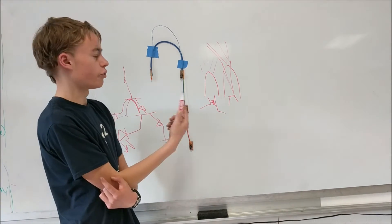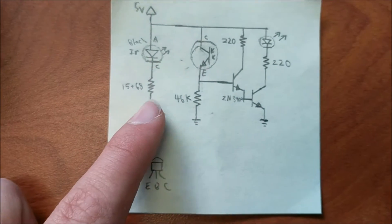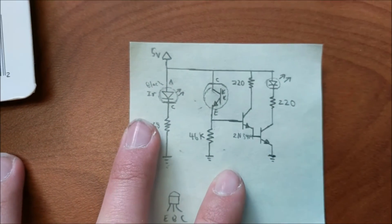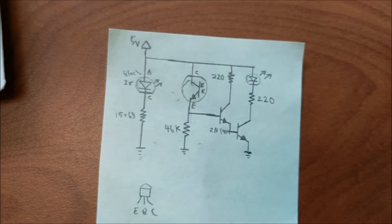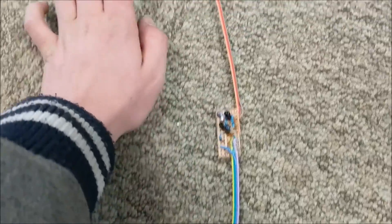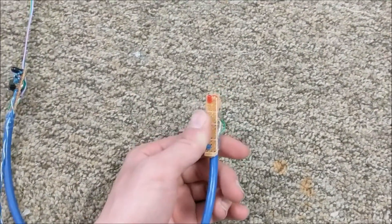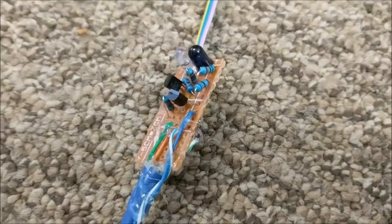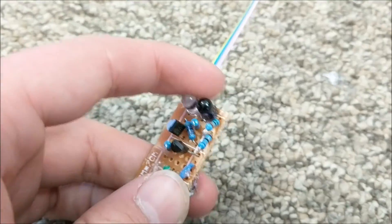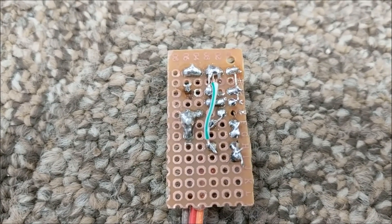This is basically how the whole circuit works — here is the circuit diagram showing each stage of the IR sensor. I have three of these daisy-chained together wired in a way that forms the candy cane shape. This is the power wire, these are each stage of the infrared sensor, and over here are the three LEDs that output the ball's position inside the tube. Each circuit board uses five resistors, two diodes — one phototransistor and one infrared LED — and two transistors, all soldered together on the bottom according to the circuit diagram.